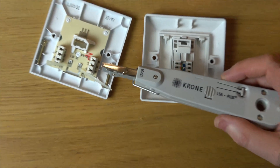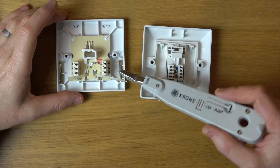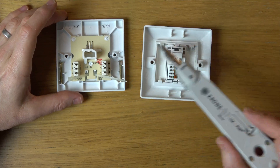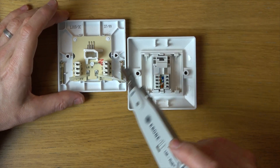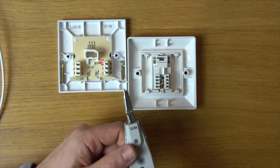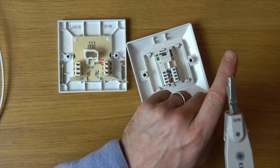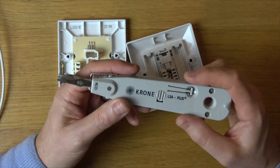You might be wondering why you would want that. Well, let's say if you were to put a wire in and you want to daisy chain it onto something else, maybe on a patch panel — you might want to connect up five of the RJ45s together with one wire in each slot. That's when you would use it without the cutting action. So you would punch it in, go onto the next one with the same wire, punch it in, daisy chain it to the next one, punch it in, and move on.